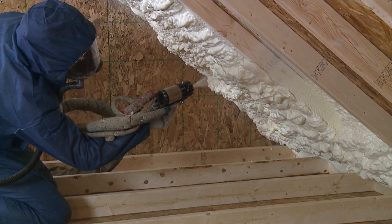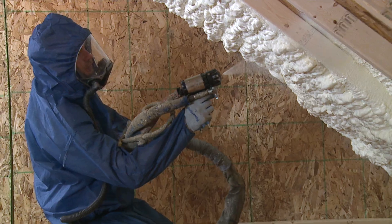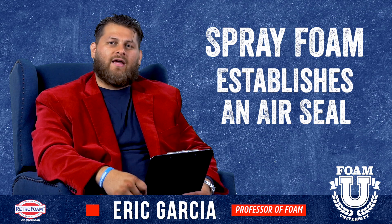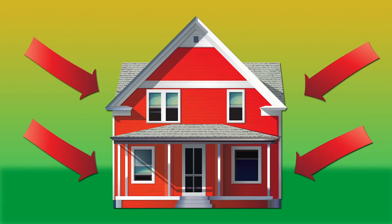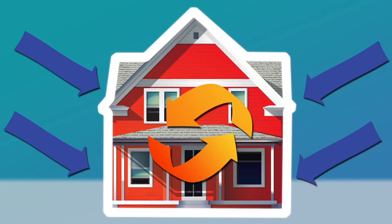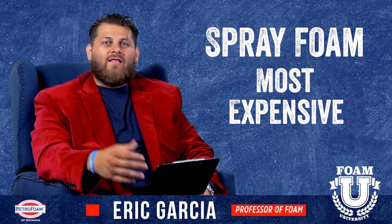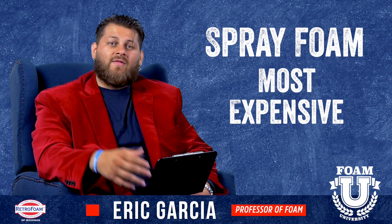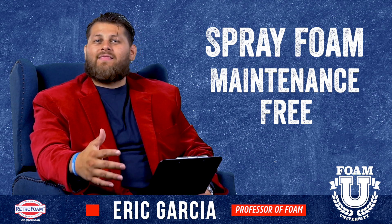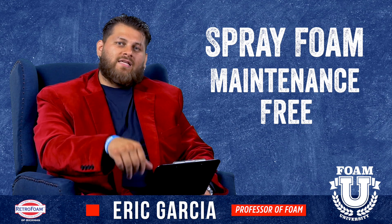An unvented system is usually what we recommend, whether that's an existing house that's been there for a hundred years or a new-built house. Now, spray foam has some strong benefits. It's an air seal — it establishes the building envelope on the outermost layer of the building, which is crucial. It is the best performing insulation when it comes to thermal resistance, actually stopping heat transfer: keeping hot air from getting out in the winter and keeping heat from baking into the attic in the summertime. The con to spray foam is that it will be the most expensive product. But it performs the best and unlike the other options, you will never have to add layers or re-rake — it is a one-and-done solution, warrantied to stay in place for the lifetime of the building.